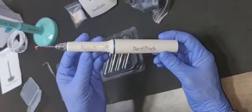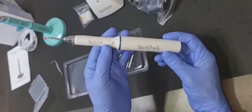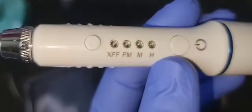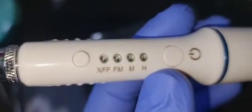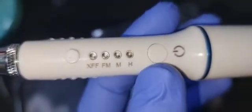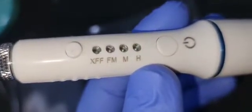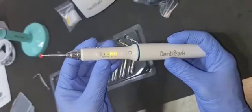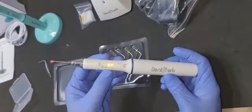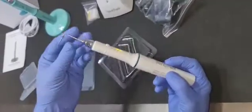You can do adjustments. When you switch on the power, the mark shown here is H — H means high temperature. If it is off, then it is low temperature. For low temperature, the power is 160 degrees, and if it is high temperature, it goes up to 200 degrees. Every tip has a marking, like X — so it has markings such as XFF, FM, and M. All the tips have corresponding markings.